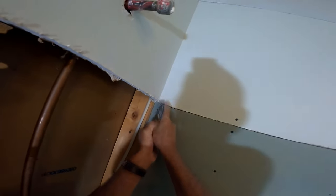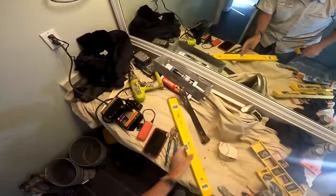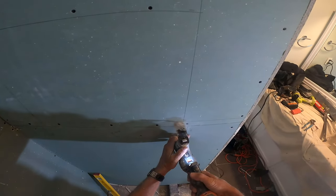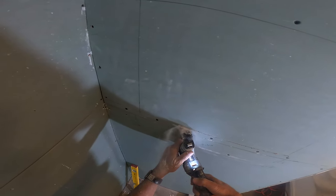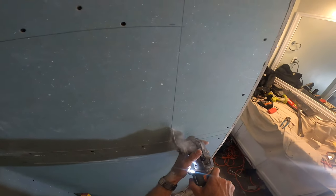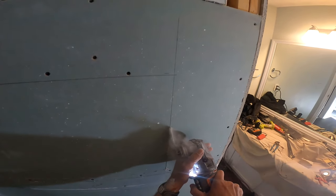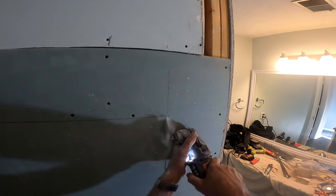The knee wall is the second failure point. I'm cutting into the tape in the corners of the existing sheetrock so they match up to my new sheetrock — there's my oscillating tool at work again. I just love that thing. Now I'm cutting out the backer for the niche that I've already measured out — you can see the pencil marks there.